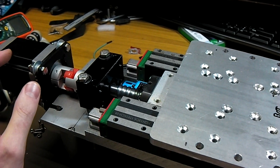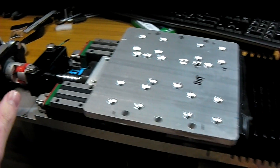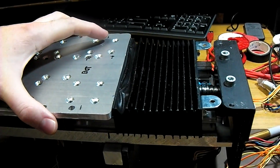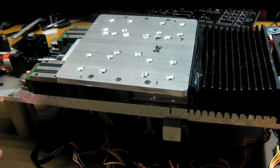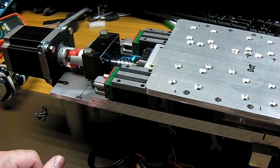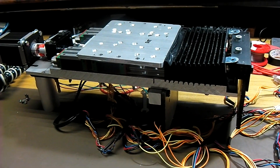The standard 3040 has about 55mm of Z travel, and something like this gets you into the ballpark of 140-150mm. You get more if you don't have the spindle mount on here, because that has to exist when compressed, so you have to take into account that you're losing that extra space. But that's it - it's a reasonably interesting build. Somewhat straightforward until you start it, and then you find all the little things coming out and making life interesting, as they say.